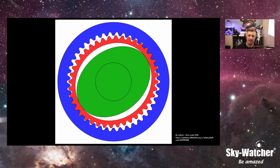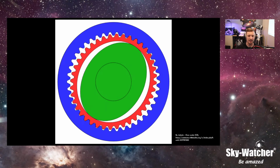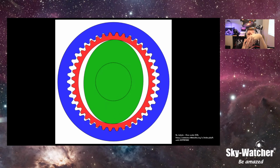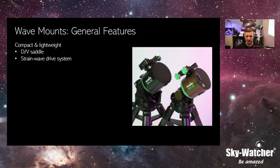You have the flex spline, the red portion there, and then you have the outer rigid gear assembly. And a nice thing about a strain wave mount, the reason that they don't have a lot of periodic error, if anything, or backlash, is because they always have several teeth engaged at once. Where like a typical drive, like a worm and ring gear used on most equatorial mounts, you only have the ring gear and then a few teeth are engaged at any one time. On a strain wave system, you can see there that there are multiple teeth engaged at this particular type of drive. So again, they're strain waves.